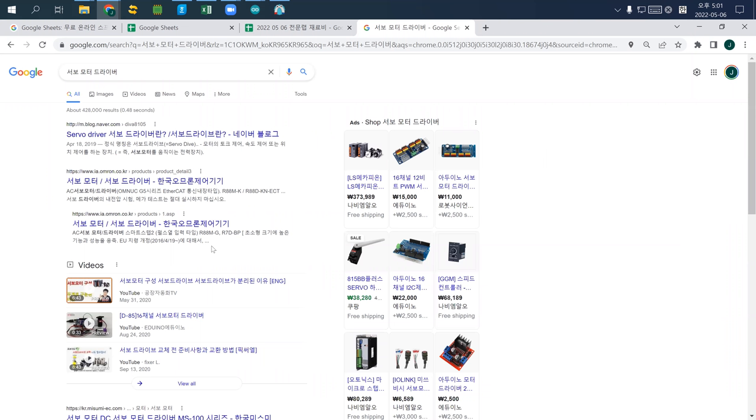You need an additional device called a motor driver. Meaning that Arduino only works with 0 to 5V. If you work with other voltages, in general higher voltages, you need a middle device. So Arduino only controls 0 to 5V, and another device controls 0 to 12V or 0 to 24V.